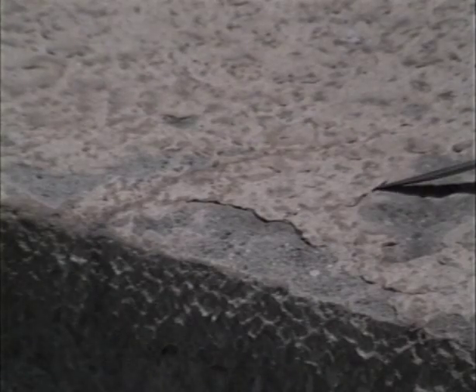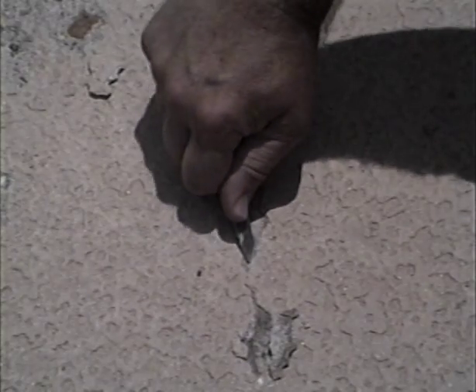Unsound concrete in this deck is the result of cracks, shifting concrete, flaking CoolDeck, chemical etching, deteriorating patches, and expansive aggregate or freeze-thaw. These problems must be repaired and/or removed before continuing.